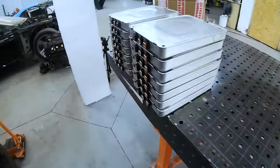Now I'm going to clean it all up, fit it to the car, and install it. The radiator is from a Nissan Leaf, the oil cooler is from a Defender I think - I just chose one with connectors on both sides in a narrow shape. Special oil and gasoline resistant hoses of the diameter we need. For the pump, I wanted one from Nissan Leaf but it costs much more, so I got one from Nissan X-Trail instead. I started fitting the radiator by hand - there's no better place than over there. Changed the angle a bit, it'll be higher and at an angle. No fan yet - I don't think we'll get the engine hot enough to require one.